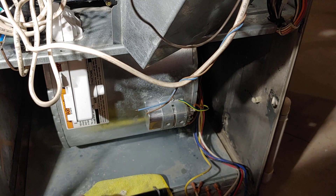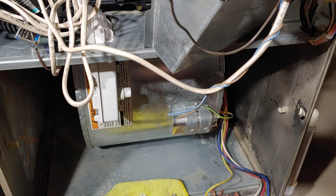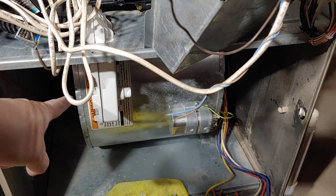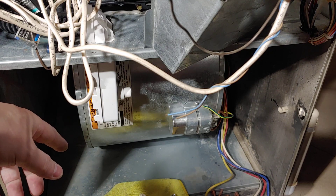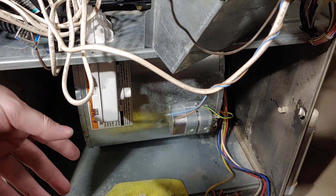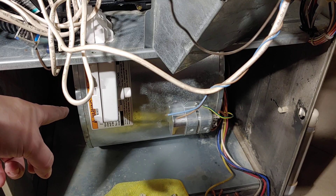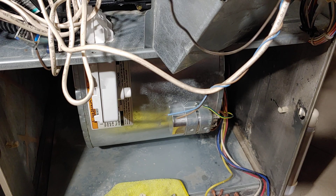While you're in here, if you haven't cleaned this out before, when you have it removed just take it under the sink and clean it all out — you'd be surprised with all the black stuff that falls out of there. I've never seen a heat and air conditioning guy clean that, even during furnace checks, which I think are kind of a joke. It's really just to come out and tell you that you need a new furnace. I've been quoted over $1,000 just to replace the blower motor — the labor and all the stuff involved is very expensive. Sometimes they'll tell you it's cheaper to just bring out a new furnace, and if the guy comes out and you spend $1,000 or $1,400 replacing all this stuff, you'd be pissed if it still doesn't work.